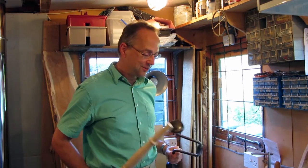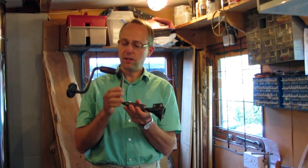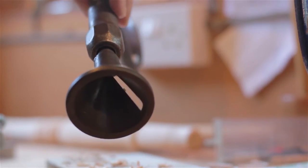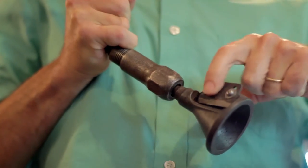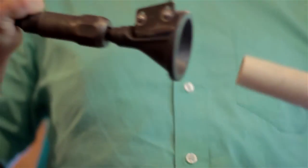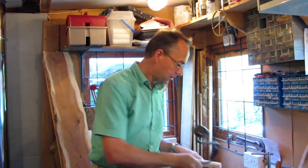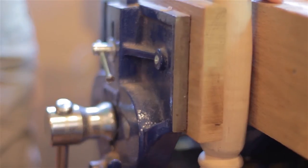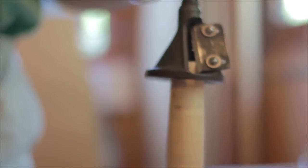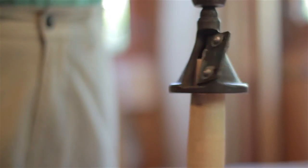Anyway, a couple of quite interesting tools to make things a bit different. The first one is this conical cutter, and it goes into an ordinary brace bit. It's got a little adjustable blade and it's a bit like a funnel with the blade in the side of the funnel. All that happens is it goes over the piece you want to round off and then you turn it. So I'll just put that in the vice and show you what I mean. There's the leg and see the cutter there — it just sits conically and you literally just turn it and it takes off the shaving to give you a nice round over.